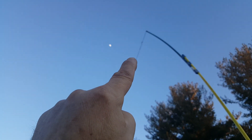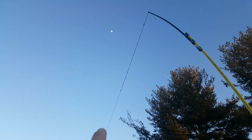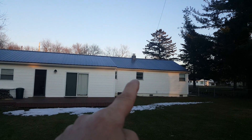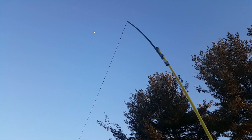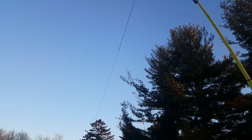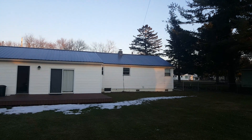This is 18-gauge speaker wire, single conductor. It leaves my window at six feet and reaches 16 feet up top. I'm going to show what I've been finding with a 150 picofarad shunt cap on the input — both with and without.